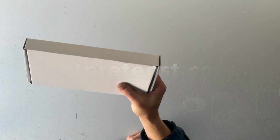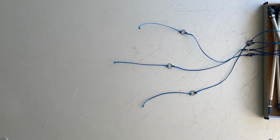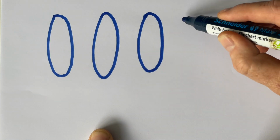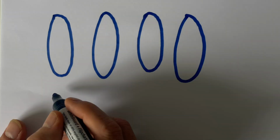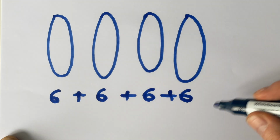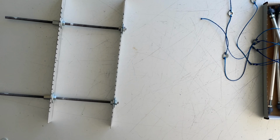Well, it just so happens that I still have the 6-twist tower packed into a box, so to make the 10-twist tower, we start with 6. I just have to disconnect the ends of the tower and extend the tension network all the way around the circle. We're going to need to add 4 new tension hexagons, so that's what I'll make first. 4 hexagons is 4 times 6, so I'll need 24 cables of the shorter length.